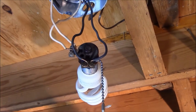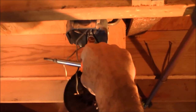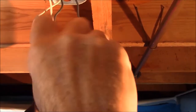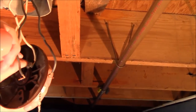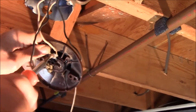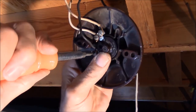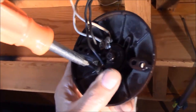So what we do, we just take it apart and we put the new one in. Mind you, we have disconnected electricity before we started this project. So now, to put the new fixture back on, take the loop and put it to the screw. The white wire goes to the silver or white metal screw, and the loop is going in the direction that when I tighten the screw, it secures the wire around the screw. These two white screws are the same - they're in the same metal bracket, so it doesn't matter which one you use. This is one of the most common mistakes people make when tightening a wire around the screw - if you put the hook on backwards, it will loosen. Tighten it extra tight and the wire is bent around. We also have the advantage of full contact - the wire and the metal aren't hitting just with a little bit, they're hitting for a lot.